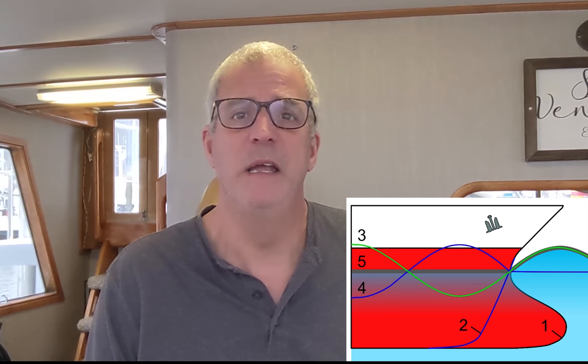The bow of a boat makes a bow wave. The Bulbous Bow makes a separate wave by itself, and the two counter each other out when built and installed correctly. This is where it gets really complicated for large ships — these two waves have to be exactly opposite each other to work. For large ships, they operate at a very specific speed and a very specific depth in the water. When designed correctly, the Bulbous Bow cancels the other wave out, creating a second wave that's directly opposite it, and the net effect is the ship moves through the water more efficiently.